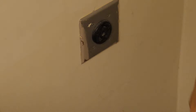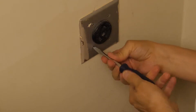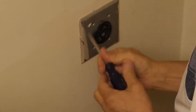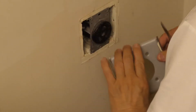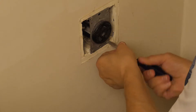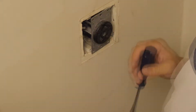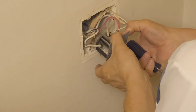You can now remove the faceplate. I'm going to do all this with one simple flathead screwdriver. After all the screws are removed, simply pull the receptacle out exposing the wires. It will be stiff — pull hard. You can't break anything.